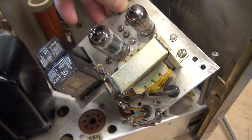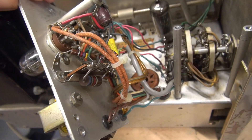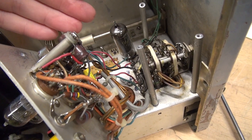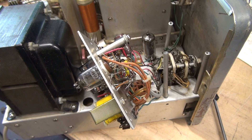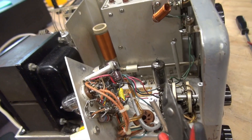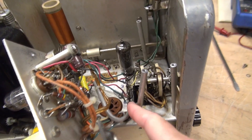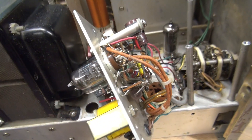Here's a close-up of the master cobbling job of the keyer platform. There's a little control power transformer, two ice cube relays, screws underneath, and a whole bunch of nice wiring. All these supports were loose, allowing the platform to contact the function switch, which was shorting out. So it's a good thing that I initially brought this thing up on a Variac. It is not safe to operate until I reverse all these mods and get this thing back into stock condition. This gray cable takes off under the chassis and comes back to that cinch connector, so we're going to get all that out of the way.